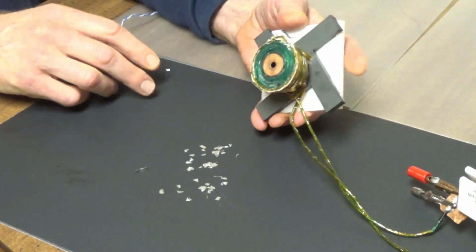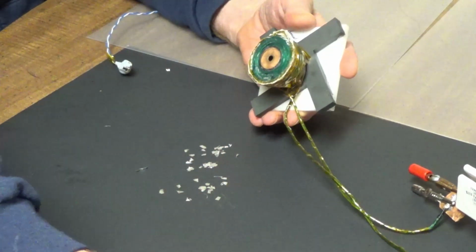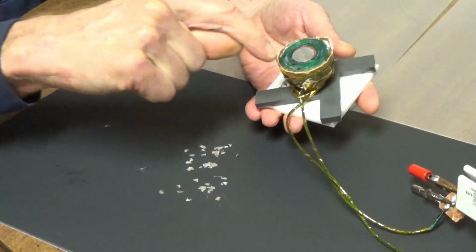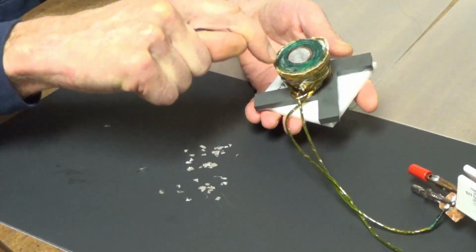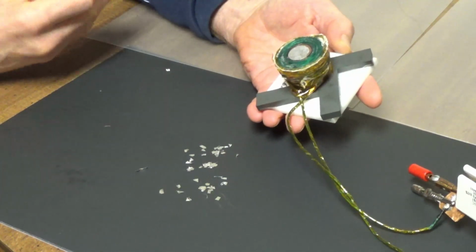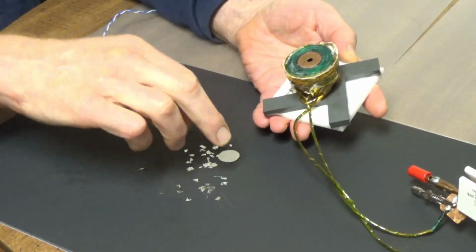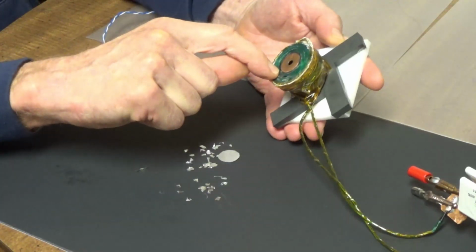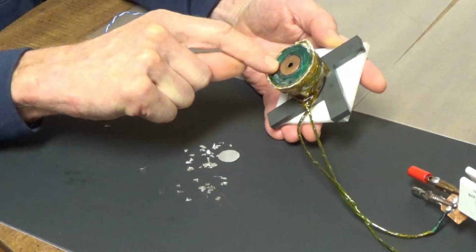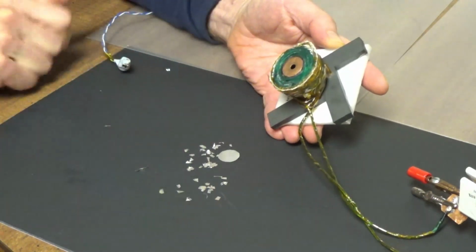And that's because this works by setting up eddy current around the rim of whatever you're picking up. So you pick up an aluminum disc, it's the current that's induced around the rim of it that causes it to be lifted. Magnetic field is coming out from the edge of the ferrite that you can hardly see here, between there and the winding and the copper that blocks the center field.